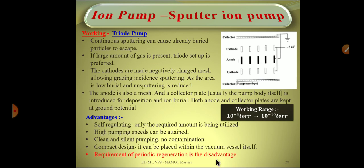The only disadvantage is periodic regeneration. After long-term use, the ion collector surface becomes saturated with deposited atoms and cannot accept more, reducing efficiency. To prevent this, the surface must be periodically regenerated by proper methods. Overall, the ion pump is a very efficient high vacuum pump of the capture type, with self-regulating operation and high pumping speeds as its major advantages.